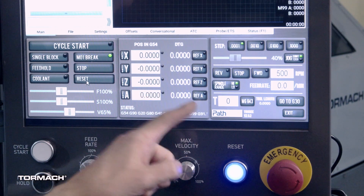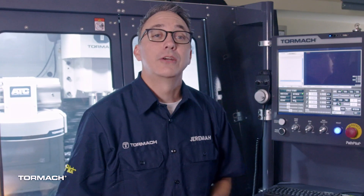And if you have a fourth axis, the A axis, this will be the proper time to reference that as well. One side note: jogging the machine, or moving the table in the X or Y plane or the spindle in the Z plane, is possible before referencing the machine. But here's the deal — the machine should be referenced before jogging to avoid running an axis into the end of its travel.